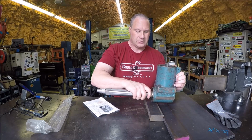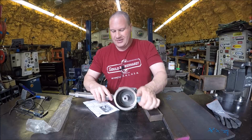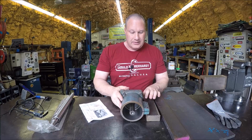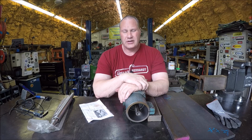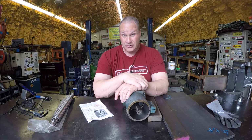As you guys know, I have an Accelo mill. It is the Canadian version of a Bridgeport. And of course the R8 taper doesn't want to loosen here. And there we go. It's a little bit beefier than your standard Bridgeport Series 1. I'm not a Bridgeport aficionado, but I think the Bridgeport ones are like 1,900 pounds? So my mill comes in about 2,900 pounds, so it's 1,000 pounds heavier, which means the base is a little larger, the column's a little larger, everything's a little bit bigger, including the quill.